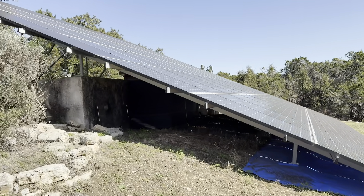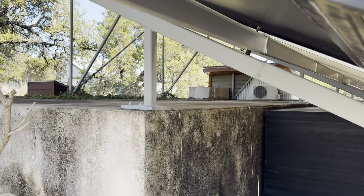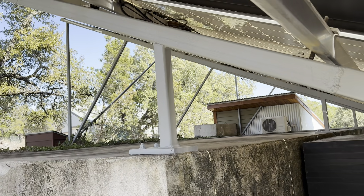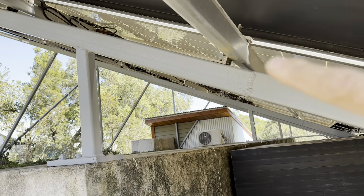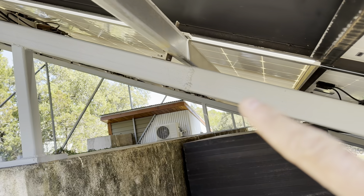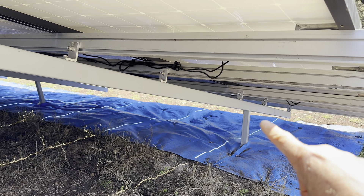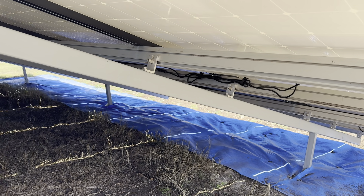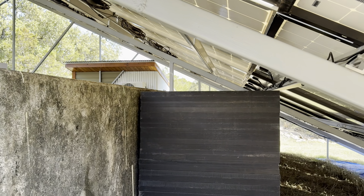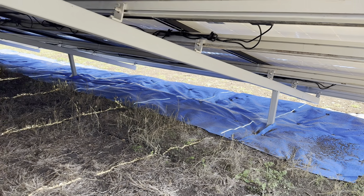The original system was mounted on this steel structure that sits on top of my rainwater tank, and it ended there. What I did was take the same steel tubing and add pieces that extended it on down. This piece of steel tubing right here is the support leg — there are four of those. They go into a 900-pound chunk of concrete that I poured in the ground, dug down to solid rock.